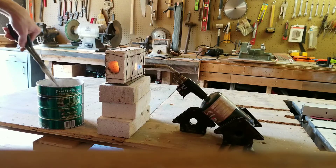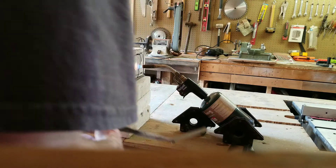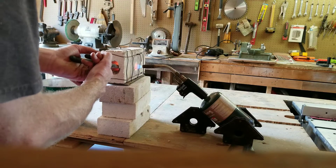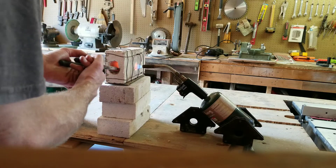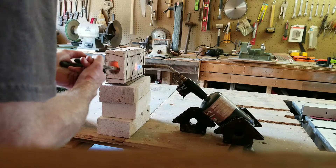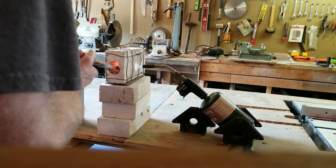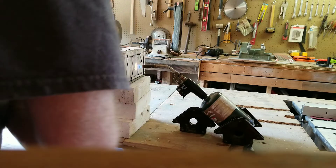See, they're bending as I put them in, so I'm going to have to straighten them out before I even grind on them. Hopefully I got the wood ash hot enough. I just used my torch there — I pointed it down in the ash and mixed it up with my pliers. Got it as warm as I could. I'm sure they'll be soft enough to grind easily.